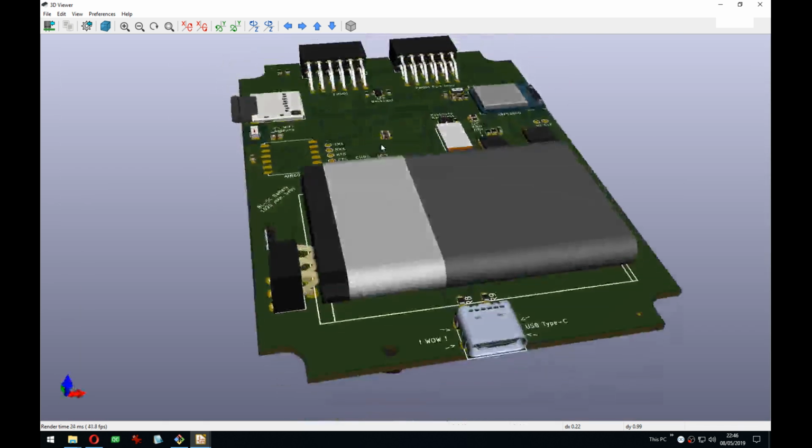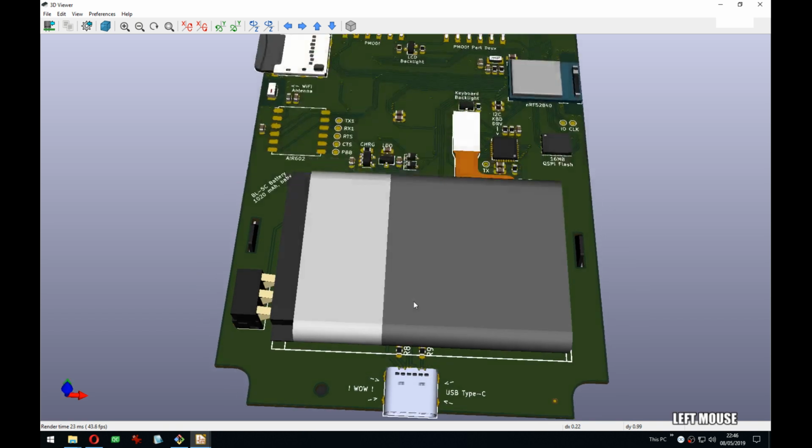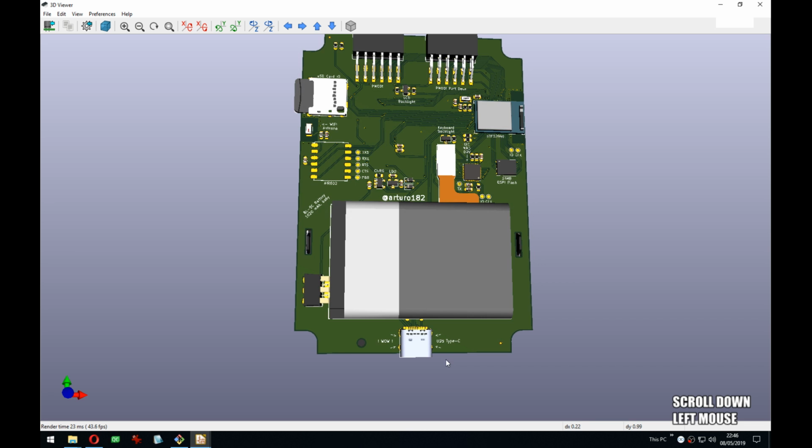And a Nokia battery with the connector. See, so I really like the position of this, and it was really nice to actually charge and connect. Like it felt good to hold it and just plug it from the bottom. You can't really have this, I guess, or can you? You know what? You could have it. You just won't get the data, but you can connect the V-Bus. So you could charge it over this port, but wouldn't get access to the bootloader and all that. So that might be confusing to the user, and it's probably not worth putting a like $1 connector just for charging on the bottom.